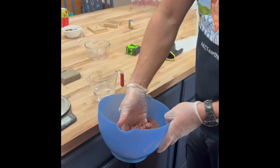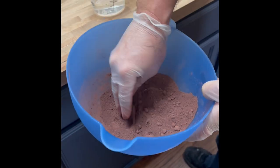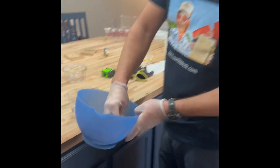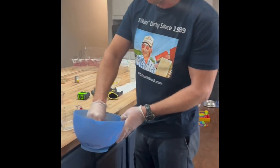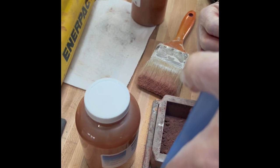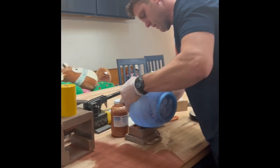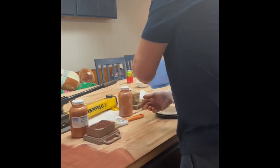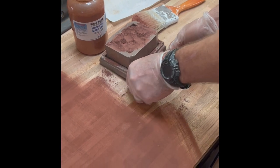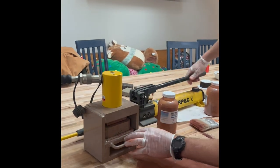All I've done is add a little bit of moisture — you can barely tell — but now you can see it wants to stick together with just that small amount. Let's give this a shot. If we have to do another round with a little more moisture we will, but we might be getting close. That'll adhere as a complete compressed Mars block — not a compressed earth block, but a compressed Mars block. Same thing: put it in the mold of our small block press and give it a smash up to about 2,000 PSI.